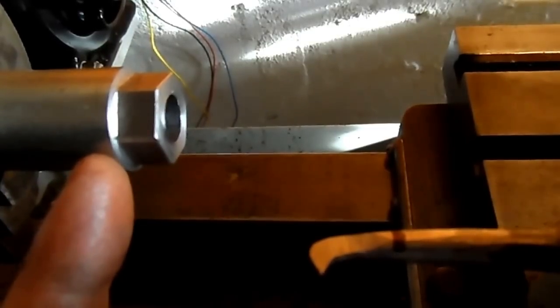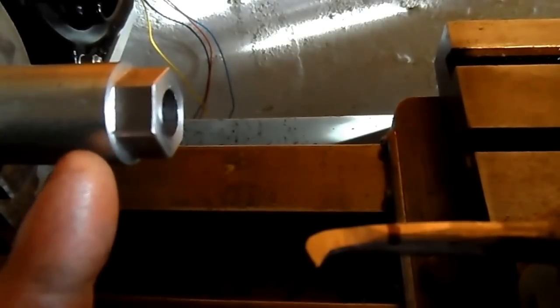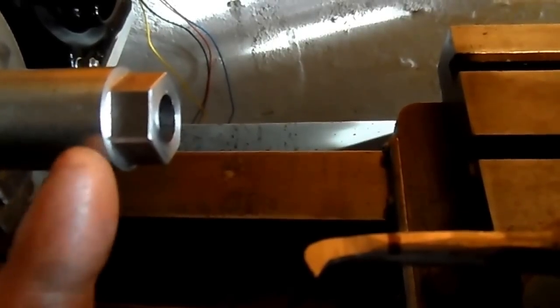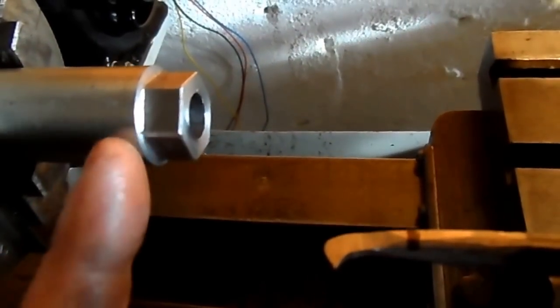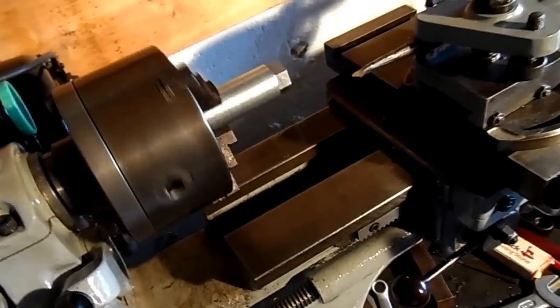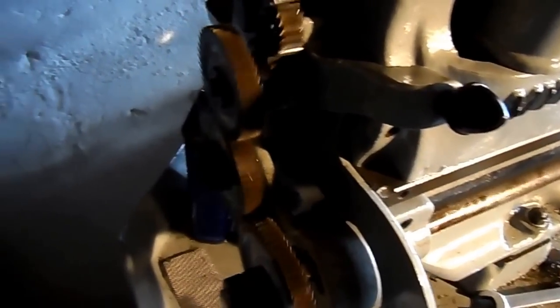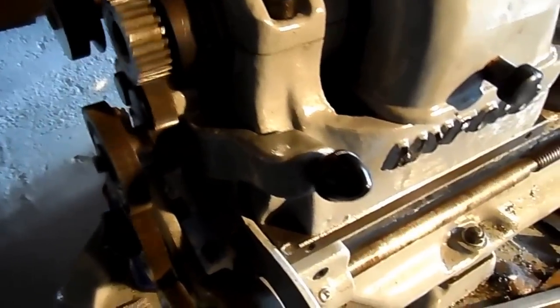I'd ideally like to put a small recess at the back, but I don't know if I'll go ahead with that yet. My first order of business is to drill the hole a little bit deeper, and I'm set up to do that now. I'm going to turn the lathe on. It's running in the slowest gear possible, and everything seems to be running sweet — very little noise from the change gears, not a lot of vibration.